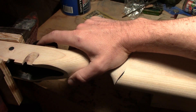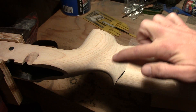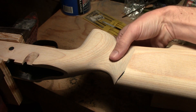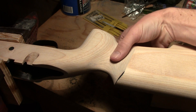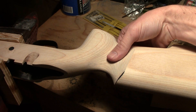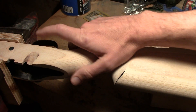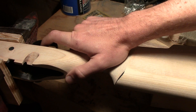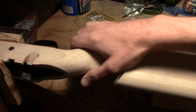This is actually feeling very, very good right now. I would take away a little bit more back here under the heel, but at this moment I have about an inch of laminate left at the back of the grip, and I probably don't want to get much thinner than that. Laminate is tough, but I don't want to make an overly thin stock or have any sections that might break. It feels quite good, especially in the prone where I have my wrist at a more severe angle.